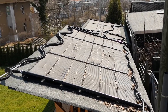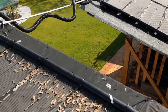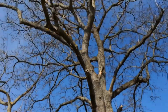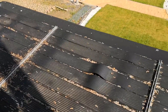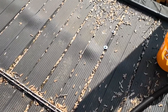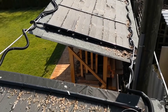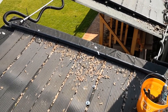This side has been there longer and is exposed to the sun earlier, so its effectiveness is considerably higher. On the other hand, I have the problem that this solar system is shaded by a tree. When the tree is fully leafed in mid-summer, I have no sun from about 3 to 4 pm anymore, which makes the solar system no longer effective. Therefore, I will rearrange a part of this solar system to address the defect on one side and at the same time utilize the possibilities of the other side more effectively.